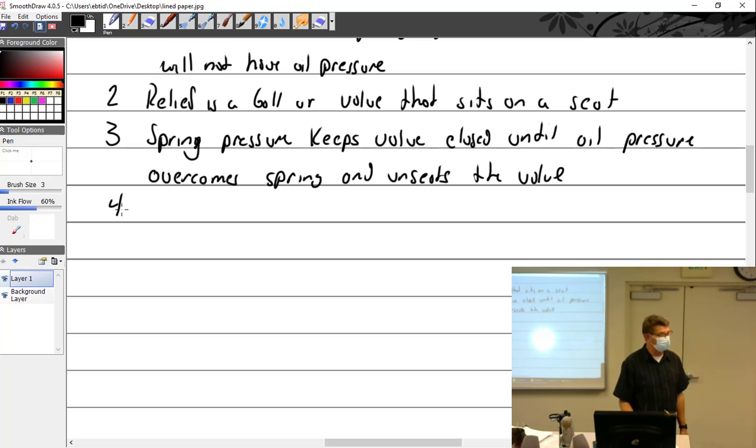And you're going to see, look, I got 50 PSI or I got 100 PSI, but it doesn't mean it's flowing to the engine. It's just in that particular line, perhaps. Depends on where the oil pressure is taken. Like my engine, it's taken off one of the galleries, so it's got to go through and then down in the engine and then back. So you do have to be careful with that.